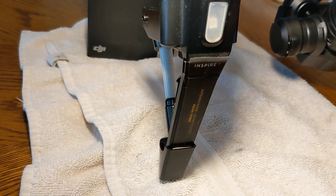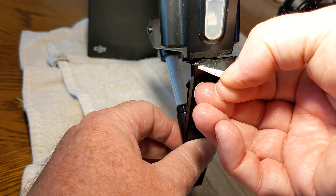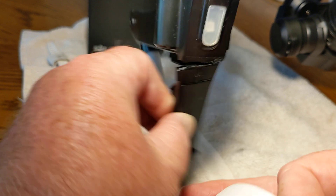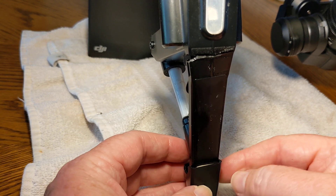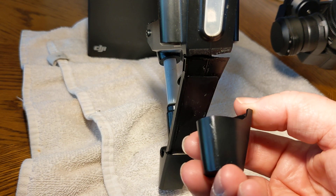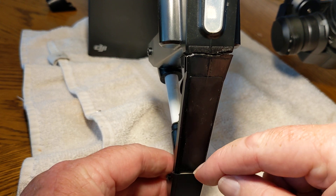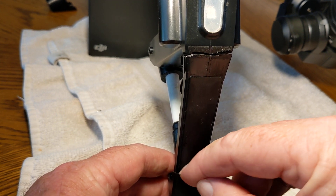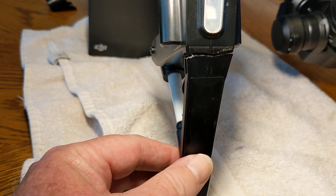If your drone is still original as mine is, it has a sticker cover over the front. We're going to have to remove this to get to the antenna in the landing gear foot. We also have a riser on the bottom here — here's what that looks like. This riser you would need to remove to get this cover off. What I did was drip some rubbing alcohol down in there; there's a foam sticky pad in there holding it in place and the rubbing alcohol will help it loosen up so you can pull it off the bottom of the foot.